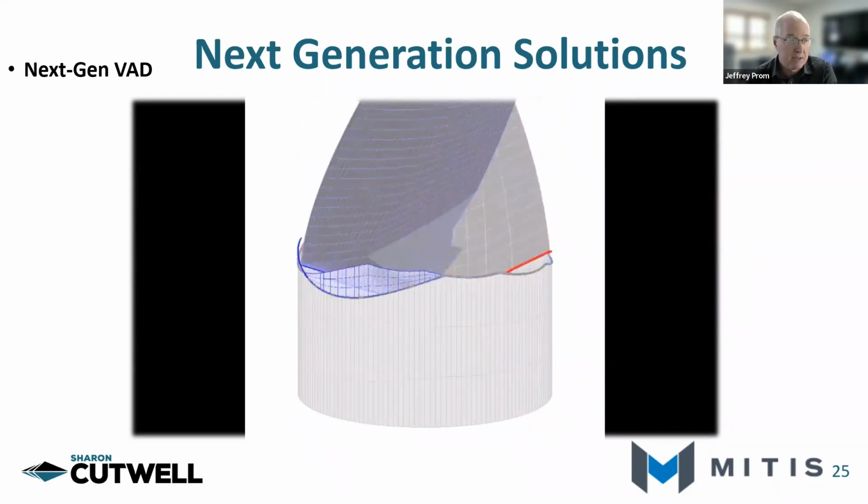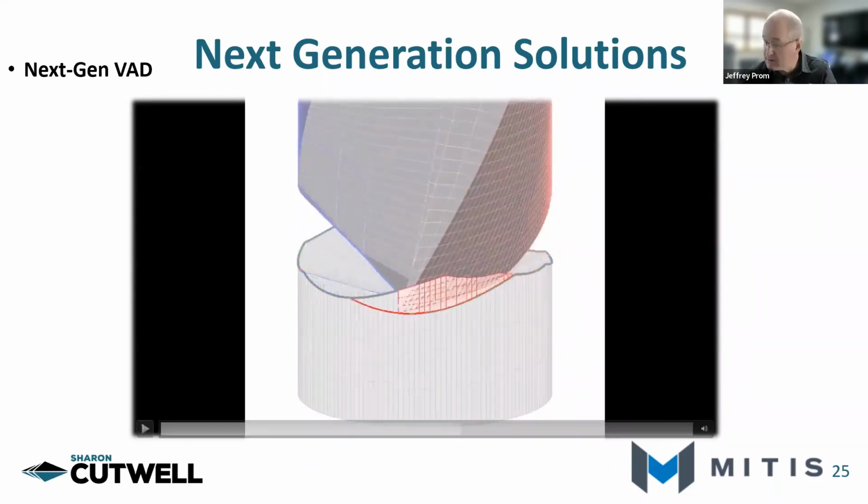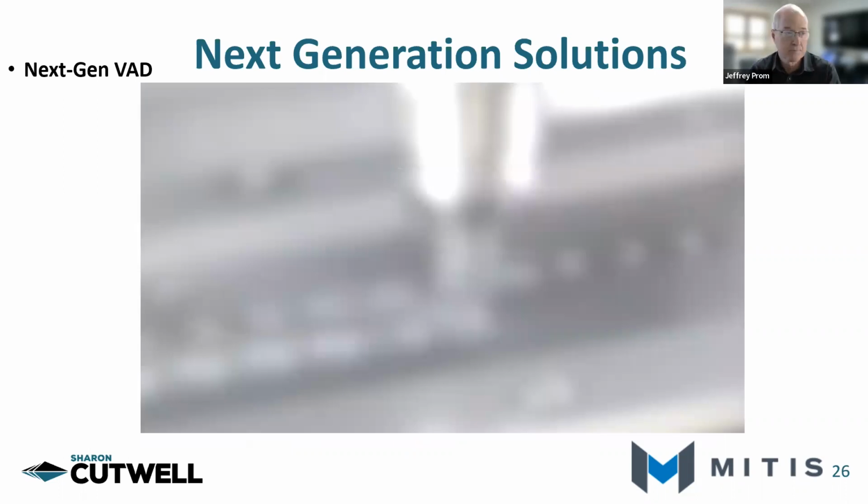One thing that we found is that in numerous applications, our P3 drill that we have for aluminum pairs very well and stands up very well in VAD environments, in the micro peck environment. Our geometry tends to allow the chips to break up very nicely and even more efficiently than other typical geometries.